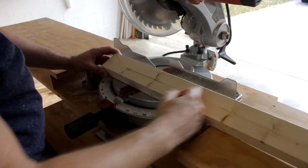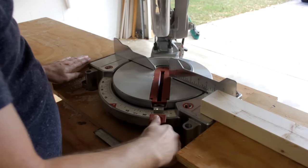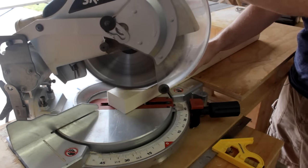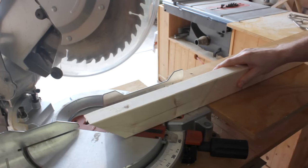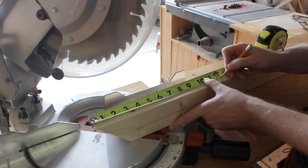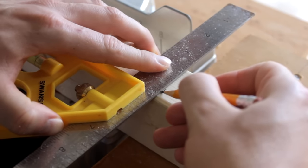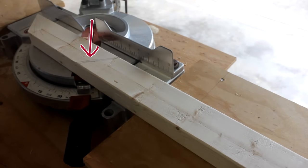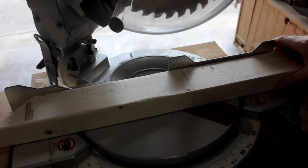Now I am ready to make my first cut, and no, I am not measuring anything at this point — I just want to make sure I get the angle cut in the right direction. I will then flip the board on its end, making sure the longest side is up. From that side I will mark to my final measurement and extend that mark. If I flip it back on its side, I can't see the mark and the cut ends up in the wrong direction. So I just flip the board over — now I can see the mark and my cut is in the right direction.